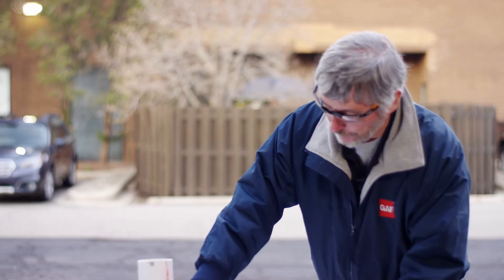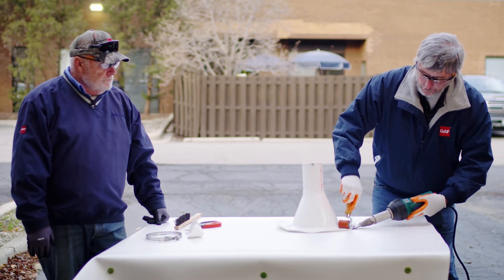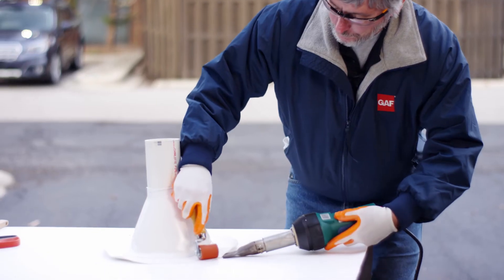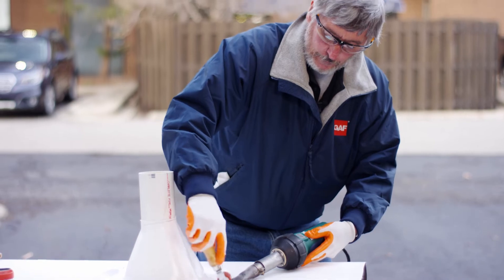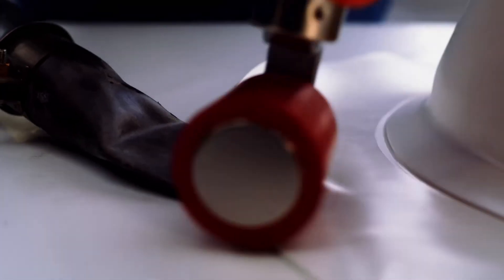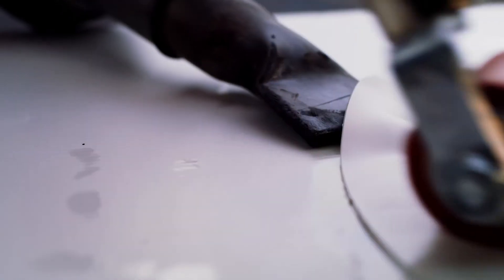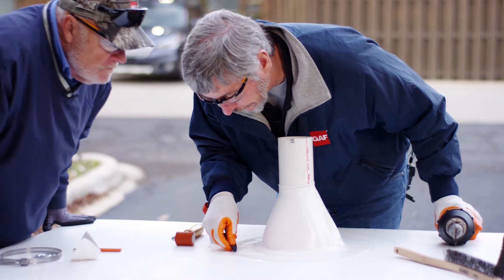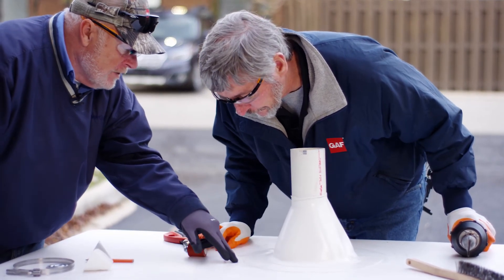I'm still doing a two-pass weld — I'm actually going to weld this whole thing down. You can see the bleed out. Notice the smoke and the bleed there. Right here I've overheated it on purpose — this is what we don't want to see, but you're not going to see a big line of bleed out. You might want to knock some of the stuff off the end of your tip, just like we did on the regular. That's pretty much it. You can barely see the white — you can see more of a shine or a glaze, if you will.